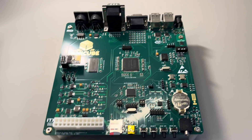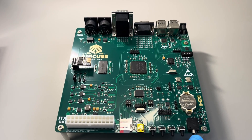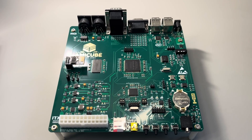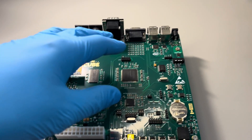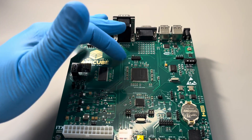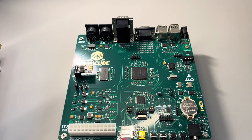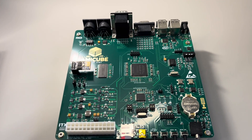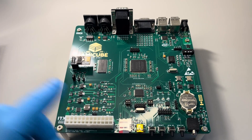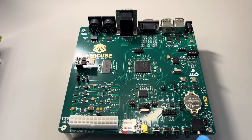There is a tape pin here which can be used theoretically on Amiga if the core supports it, perhaps in the future. But it can also be used with different cores, because although I designed this primarily as an AGA Amiga board, because this is an Altera Cyclone 3 this board can support 50 different systems — from Sinclair, Commodore, PET, Commodore 64, Atari ST, all the way to some low-end PCs and Neo Geo as well.